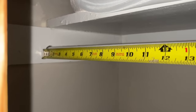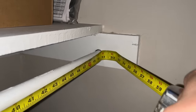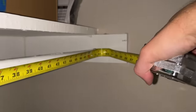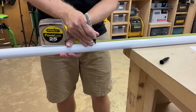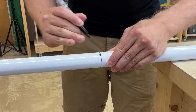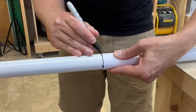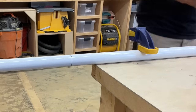Assuming you already have plates, the first thing you need to do is measure your span from wall to wall. You may need to bend the tape to do this — you're looking for a surface-to-surface reading. I go with the measurement about a 16th shy of the total opening; in my case, just under 51 inches. Now pull this measurement on your metal closet rod and make a mark. Use a rolled-up strip of paper with a straight edge to transfer this mark around the circumference of the tube. Then brace or clamp your rod on a stable surface and cut through it with a hacksaw.